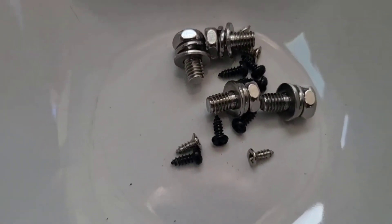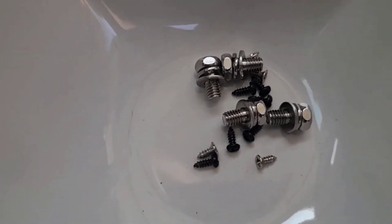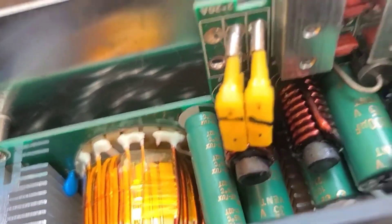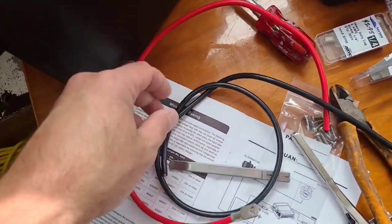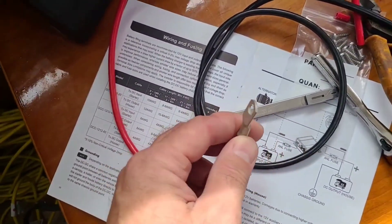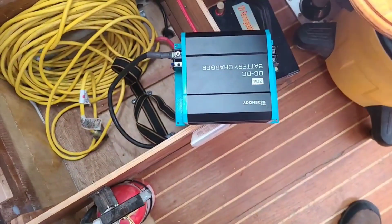Honestly, I hate when manufacturers use screws in electronics — I don't see any problem with using proper bolts. There are two fuses inside so I need to get spares. I just need to check what rating — 220s, yeah that's fine. So I had to drive to the local store to get wires because I didn't have any. As per calculation I need to use gauge 10 or 8, so I took 8, and I also got terminals, bolts, and nuts.